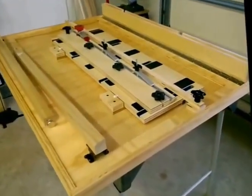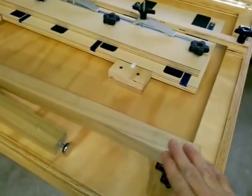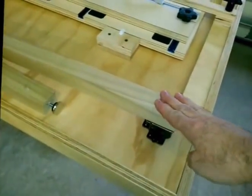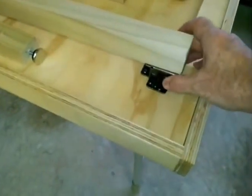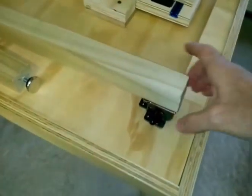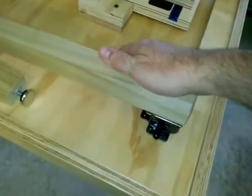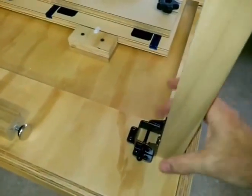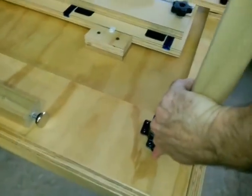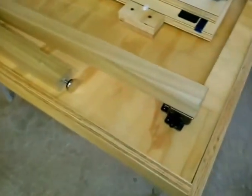This is the underside of the table to give you a quick better look at my concept. Down at the base end right here — the part that hangs down, farthest from the table saw — I got two hinges from Rockler. I like these because I could have made them with just wood and a bolt, but these have secure locks where they lock in the upper position. You hold it like that and lock it that way. When you go to lower it, it locks it down. So I have them on both legs.